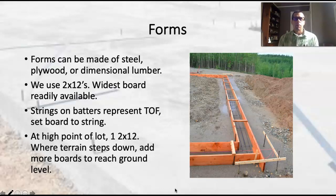In some parts of the country — and I've only done this once — people use steel forms. They're actual steel panels with a plywood face, and there's little pins, and they're all these kind of preset widths. You set them up and they set up pretty fast, and they're really strong. They're just really expensive and really heavy. They would make sense if you are building the same type of foundation over and over again — you build the same house 50 times a year. It would make sense to utilize those kinds of forms because you could just have them at the exact dimensions that you need.